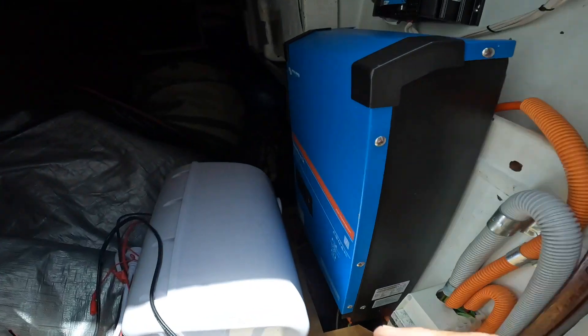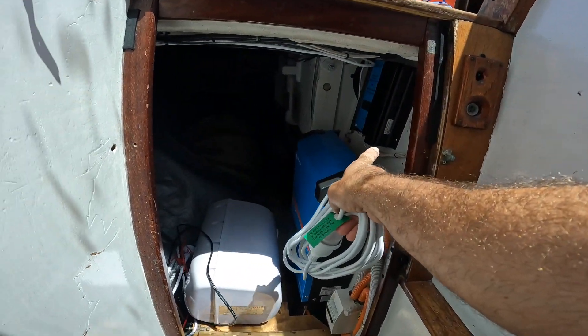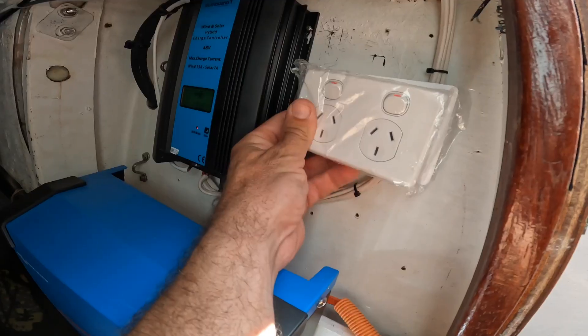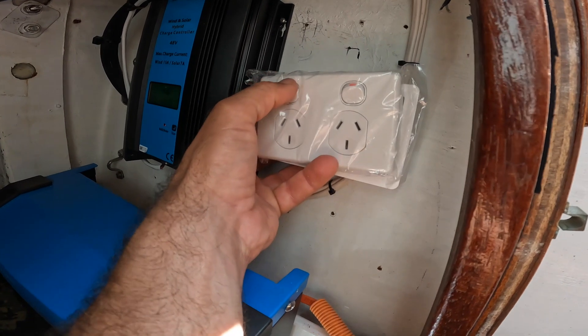It's time for some wiring. I want to put the water heater all the way back in that back spot. It has a switch on it for the 240V but I'll just leave that switch on, run an extension cord up to here, and get an electrician to install a 240V outlet there so I can turn it on and off easily. I'm also going to wire it into the 12V - I think it just prioritizes the 240V if that's on, and automatically switches over.